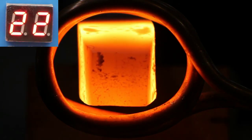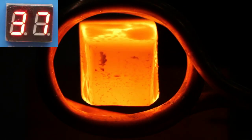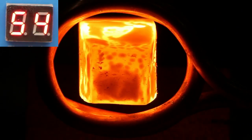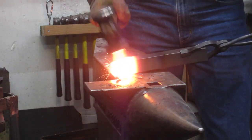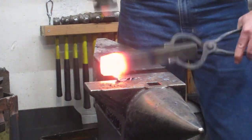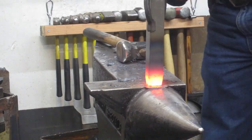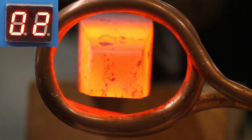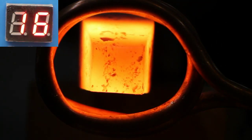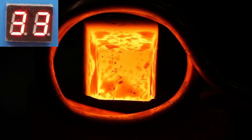I've shoved this through the coil a little bit to lengthen the heat, and I'm just letting heat run to the nose of the taper. This is going to give me a longer heat and make the operation more pleasant. Overall, this is an area where the coal or propane forge really would have a benefit - there's a ton of total heat, wasted all over the place, but that means a longer heat in this huge stock is easier. In any case, this is going to work out. I'm going to tidy up this taper and then we'll move on to the fuller ring.